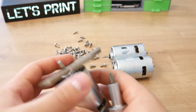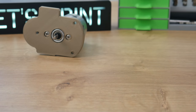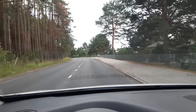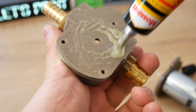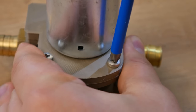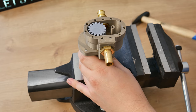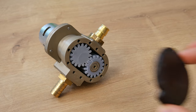Now when this is done we can assemble three gear pumps. First I attached motor mounts, then I removed supports, then I realized I didn't have enough hose nozzles so I went to the hardware store. I screwed those on and used a little bit of rubber glue between the pump body and motor mount — which was actually too much. I attached those two together. After press fitting two bearings to the non-driver gear, we can assemble those.